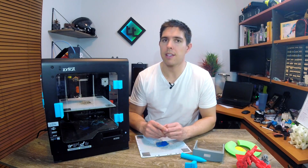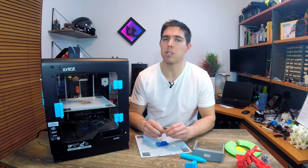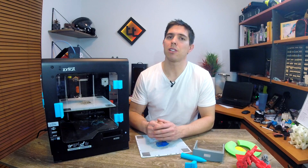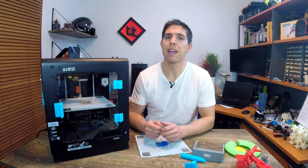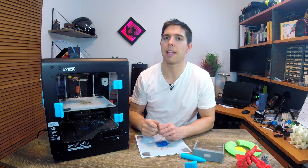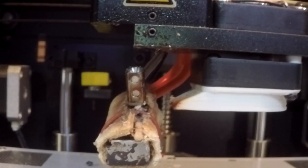This printer in three and a half years has been very unreliable — and not just this one, but the other two as well. Quite often one of them is permanently out of action and I'm just swapping parts between them to try and have two good printers going, and sometimes only one out of three at a time. It loves to clog the extruder. The nozzle can almost be treated as a consumable — we've had to change them so often, and sometimes after putting on a new one it clogs again almost immediately. The drive gear at the top also likes to clog and you need to disassemble the whole top end to clean it out. Just to get it printing for filming this video took about 20 to 30 minutes.